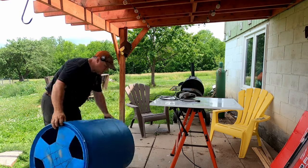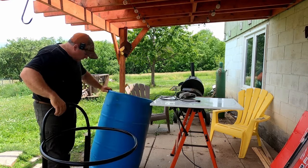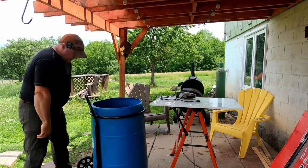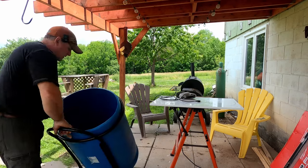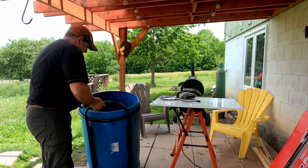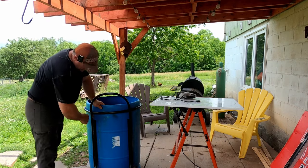I made a little frame that sits over the barrel - it goes right over just like that, pushes down and bolts on here and here. That way once it bolts on I can just wheel it around, which is pretty cool. To make this frame I had some three-quarter inch rigid conduit, bent it in a circle and welded it together for the top ring, then bent the other piece to make a handle.